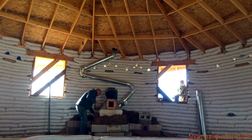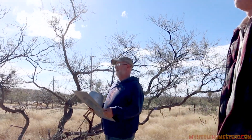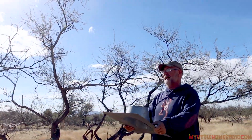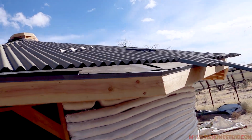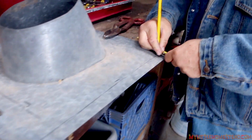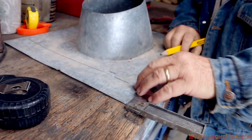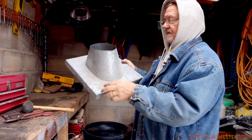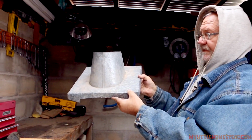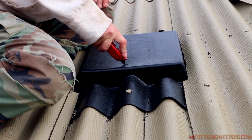We're gonna cob the whole wall all the way to the ceiling. That flange piece is perfectly waterproof now, and then this just caps right over the top of that. Great. I need to make some adjustments to our flange piece, and we'll be able to get that up on the roof. Fold down, and it's gonna fall over the top of it. This is where the fold is gonna go. This is the top, that's the pitch of the roof. Pretty tough stuff.